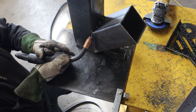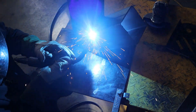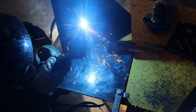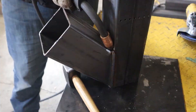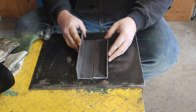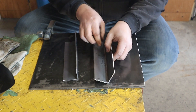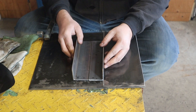I am going to tack the feed chute on now. I'll put my torch angle up and keep the puddle up so I can bridge it. Then we are going to tack the secondary air port using some 2x2 angle iron. I ground off all the mill scale, because tacks on mill scale can sometimes be problematic, so I've gone ahead and done that. We are going to be doing a bunch of tacking here before we weld it out.